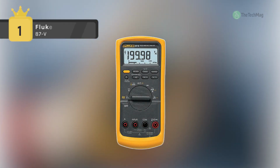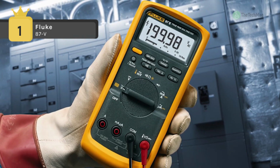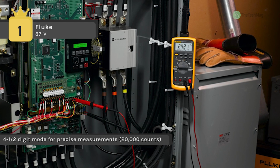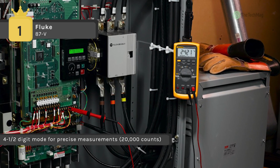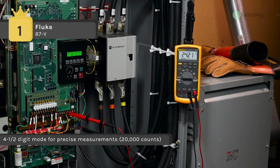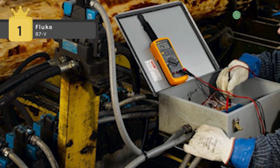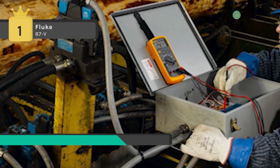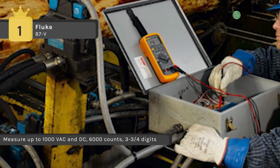Holding the first place among the list of best multimeters, we have the Fluke 87-V. It provides accurate frequency measurements on adjustable speed drives, ASD, due to Fluke designed low-pass filter. Also, it has a built-in thermometer that allows temperature measurements without a separate thermometer. Besides, it is explicitly designed to handle complex signals, and it enables you to gain productivity by taking the guesswork out of drive system troubleshooting, even in loud, high-energy, and high-altitude locations.